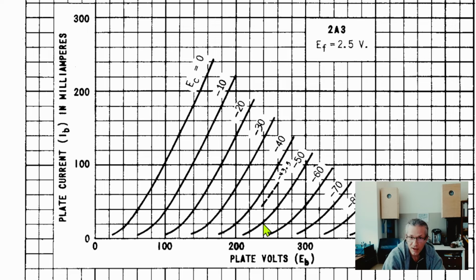I cannot think. So that's the bad thing, that when I'm trying to show something like that, my capacity to multiply even basic numbers is not there, because I'm thinking about what I want to speak, where I want to take this logically. However, let me just make this easy calculation. So we have 20 milliamps minimum, 135 milliamps maximum. The distance between them is 115 milliamps, right?